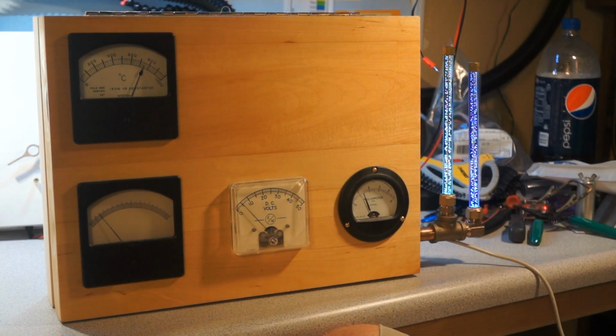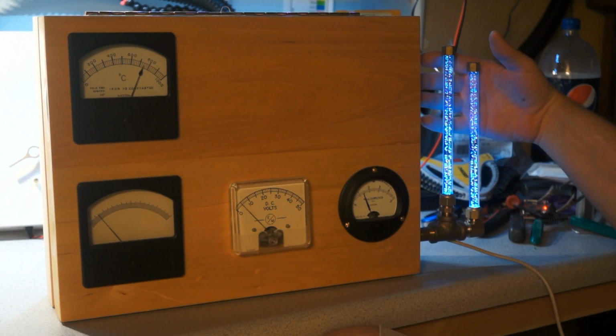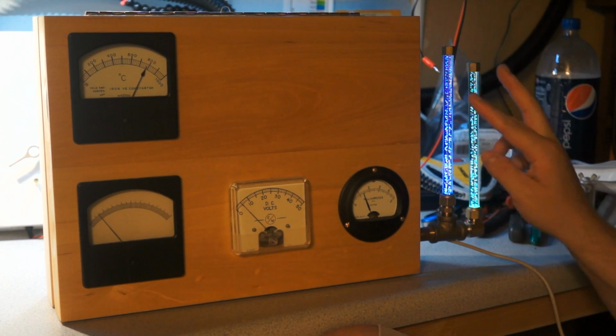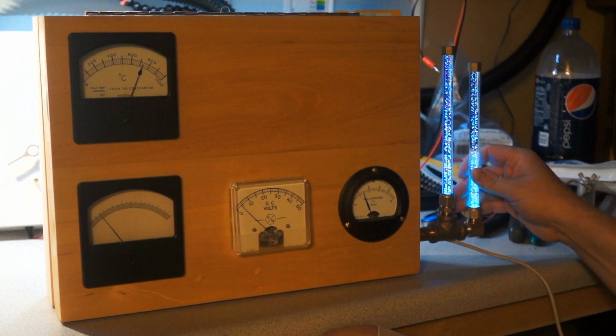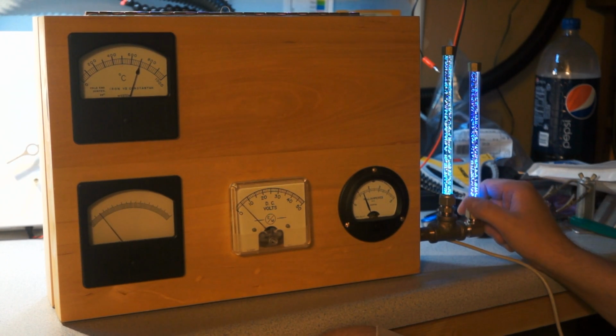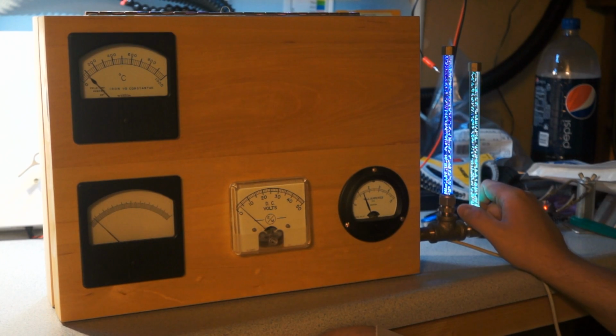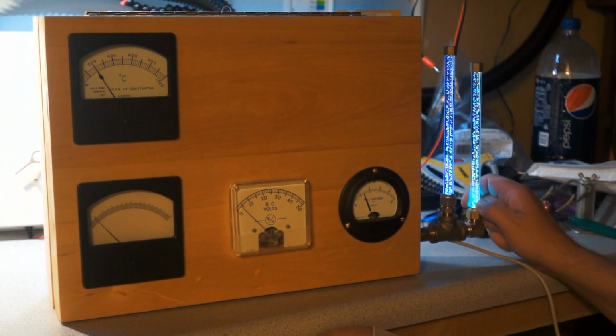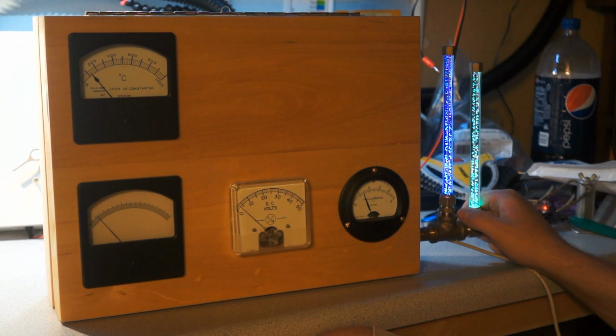So you can see there are some RGB LEDs in here. What happens is it shifts between green and blue on each half, and every time it receives a packet, it reverses the shift direction. So that's kind of its working status update, and then theoretically when there's no packets, these go red. Basically when the internet connection goes down, the idea is that it turns red. It doesn't work that well, because the network interface continues to send discovery packets, like, hey, is anybody out there? And when my modem loses its connection, it comes up with a local DHCP server that lets you query the modem status remotely, lets you look at how long it's been booted and so forth. So it doesn't really properly detect network not present, because there is always a network present, or at least always traffic on the network interface.